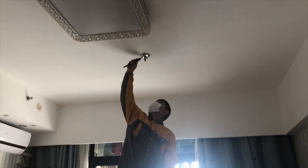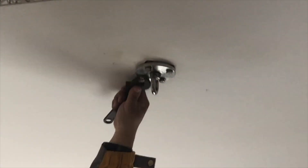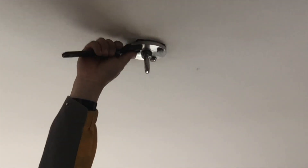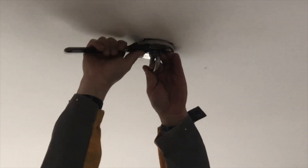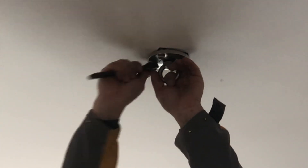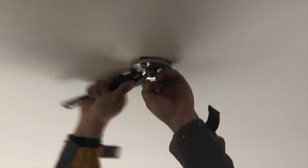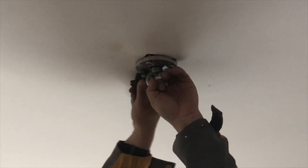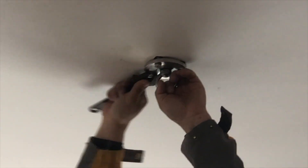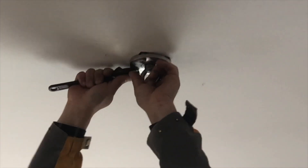Alright, so your last step is to ratchet the bolts in. This is what really makes them stay, because the top of the bolts is going to get lodged into the concrete by being forced in, and it will expand the metal shaft — that's what holds it in place in the concrete. Then here we go for a second round, making it real tight, making sure that it's gonna stay in that ceiling forever. We are never going to get these bolts out except maybe with a metal hacksaw sawing off the tops of the bolts — so this is permanent in your ceiling.